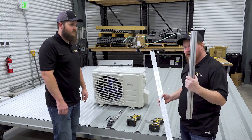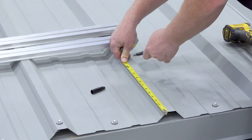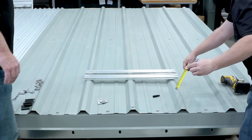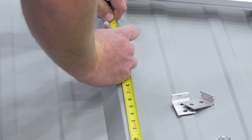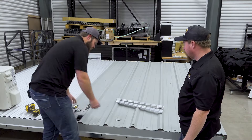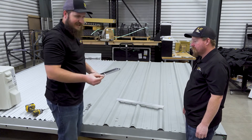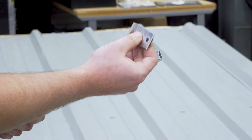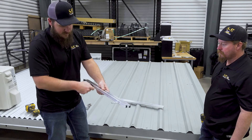So instead of cutting down a 52, we're going to use the 27. The first step is to measure up and mark where you're going to put your first attachment — I'm going to pick 12 inches here. We're going to grab our GripperFix strut and our EF tabs, and unlike the last install on the standing seam roof, we're going to slide the tab in the down position so that the EPDM seal sits on top of the rib. Just get them temporarily in place and head back to the roof.